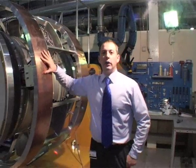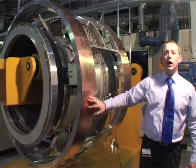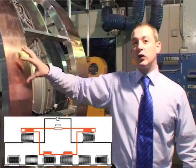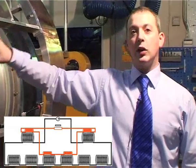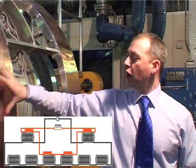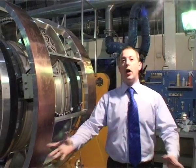Here's a finished magnet. We now have the outer cores covered with a piece of copper. This copper forms a complete ring and is used when the magnet quenches to prevent a stray field burst. As the magnet quenches, eddy currents are generated inside this piece of copper, which oppose the stray field burst produced by the rest of the magnet.